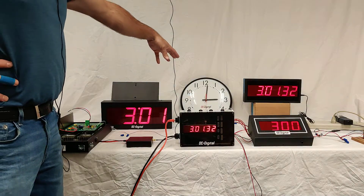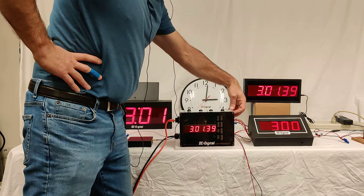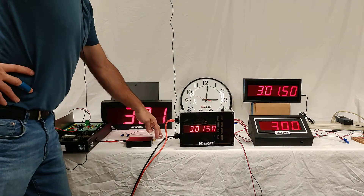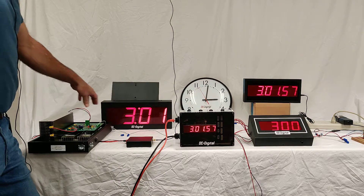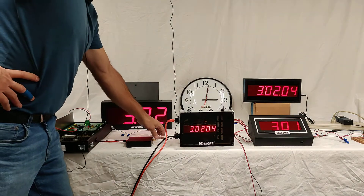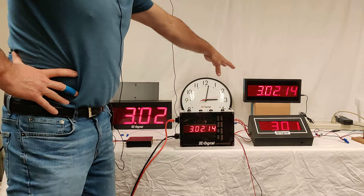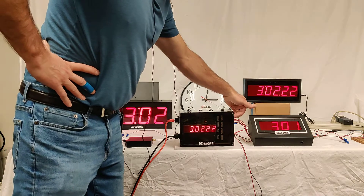If you've got an older 59-minute clock system, which a lot of facilities still do, you just directly connect it into this DC-106NCLK. If you've got an older DC Digital system that's two-wire, the green and white wire is data out that will feed to either your PS24BD, or you can also drive four-wire clocks — up to a hundred of those on here. If you've got a 12-hour reset system — noon and midnight reset — you can just wire it directly into here.